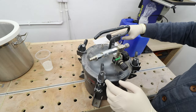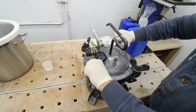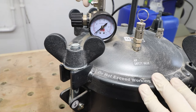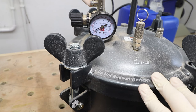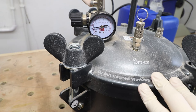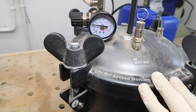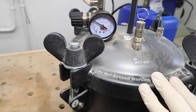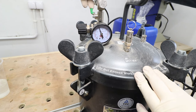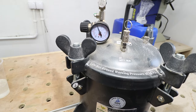We need to make sure the pressure pot is really locked tightly. By releasing the valve we can add air pressure to the tank. We need to remember to add the pressure slowly, as a strong stream of air going inside the pot can cause the resin to splatter all over inside your pressure pot — we definitely don't want that. The same applies when opening the valve to release the air — do it slowly, mainly for safety reasons. I'm at about 40 PSI, that's what I need to be at, so I'm closing the valve and can disconnect the air compressor. Leave it to cure.